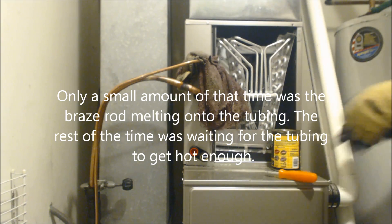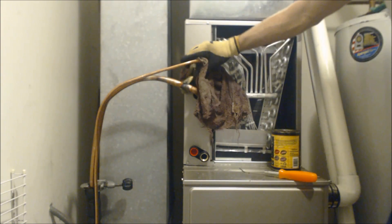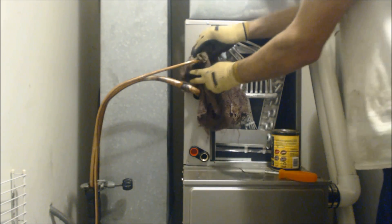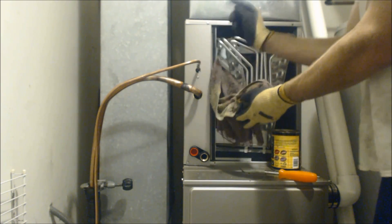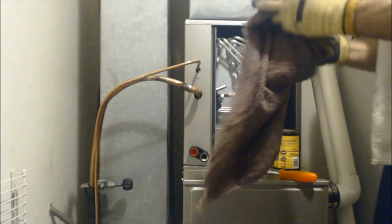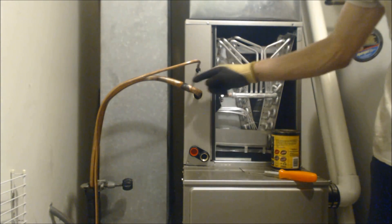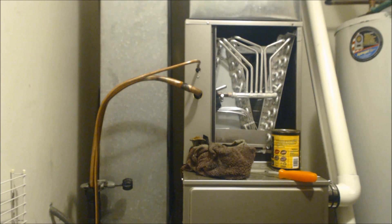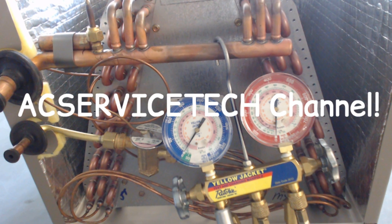As soon as possible, verify that you have the braze filled in on all sides. Keep the heat of the flame towards the back of the fitting so you draw the braze to it inside the fitting. You want to make sure you fill the whole joint up with braze - but not too much, because if you keep putting your rod on there you're going to end up clogging the screen that's inside the pipe, and you'll diagnose that later as a restriction. You want a nice thick crown on there. Now we're going to move out to the outdoor unit. I hope you enjoyed yourself - we'll see you next time at AC Service Tech channel.